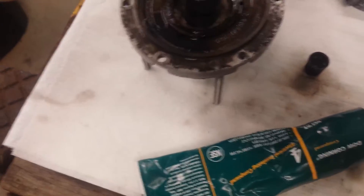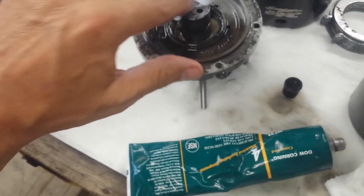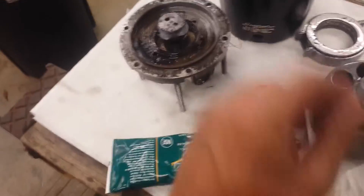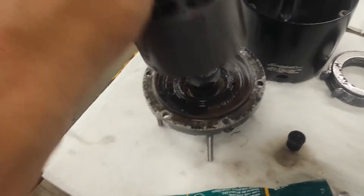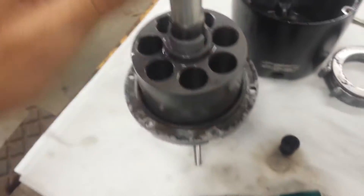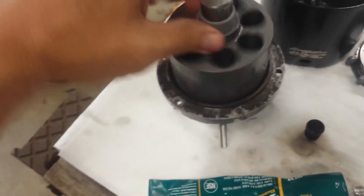Once that's in place, the spool goes in place. I'm going to lube that up with some DC4. This DC4 will mix with the hydraulic fluid and not cause any blockage — it ends up becoming part of the fluid once it's worked through a few times. This piece I've lubricated with WD-40, and that one with DC4, and it's going to go on there and spin like that.